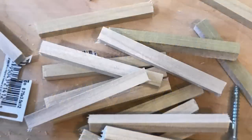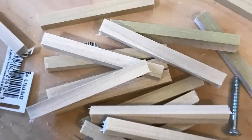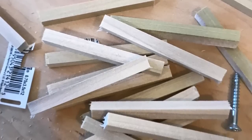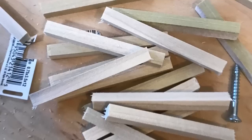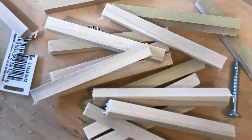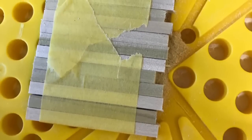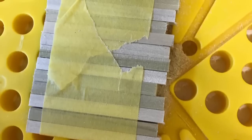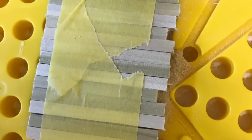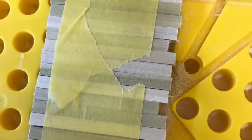These were extremely easy to slice using a handsaw, and what I did to make it easy for myself is tape all 3 or 4 of the dowels together side by side, and then put them on my handsaw and slice them at each length that I needed. So this picture kind of explains it. I took the dowels and each piece that I had left over and cut, and I just taped them together making sure one side was completely flush, and then I sliced them all at the same time using some painter's tape to hold them secure like a big whiteboard. I hope that makes sense.